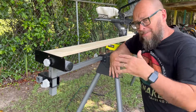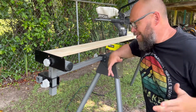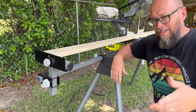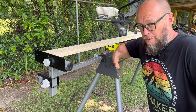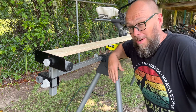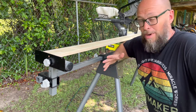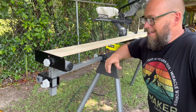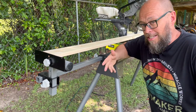We're making these 50 inches long. I've got the saw set at 50 inches so all the boards will be the same. We're going six wide per shutter. The good thing about woodworking is you can do it how you want — use 1x6s, 1x8s, whatever length you want, because your window is going to be different than this one most likely. We're cutting 12 total, six per shutter.